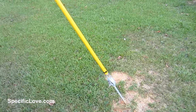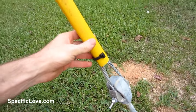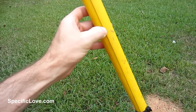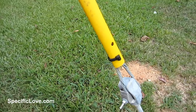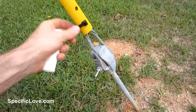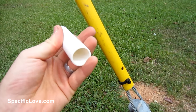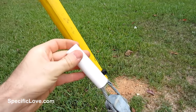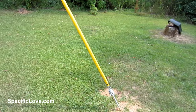Here's a great idea I discovered just outside my house. I'm pointing to the local power company's power pole, and the cable that comes down from it has a nice big piece of yellow plastic attached — pretty sure it's PVC. If you ever put up any cable or big rope and you don't want people to back into it, you can use this. It's the Schedule 20 version — a little bit thinner — and you can either trim it or just slide it over the rope before you put it up. It's a great way to make it more visible so you don't have to worry about people hitting it.